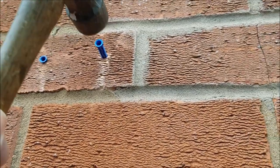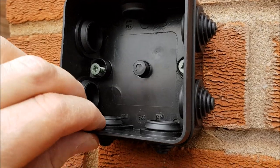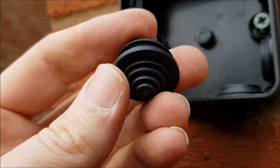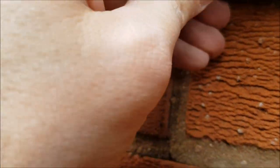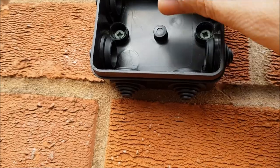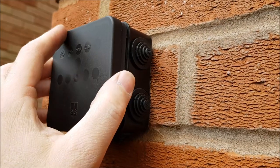Let's get some wall plugs in. Just putting my junction box on with the two bits at the bottom. As you can see you can just push these out, which leaves you the big hole to put everything through. You can just cut these to go around the cable. Pop it back in for now, then pop the caps on — that stops rainwater getting through it.